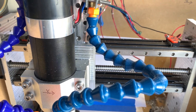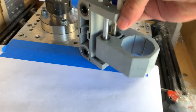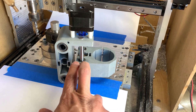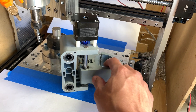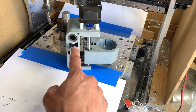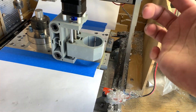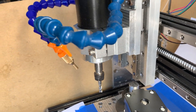To make it really solid and able to cut aluminum, I first replaced the motor, then replaced the motor mount — the gantry. The problem is it comes out way too much for the holding space it has. It's mounted on rails with no support other than on the ends, so it adds a lot of deflection and vibration. It's made of plastic, the bearings are really loose and move up and down easily, and the lead screw has a lot of play. So I replaced all of this with an all-aluminum version, machined one piece at a time on this machine.